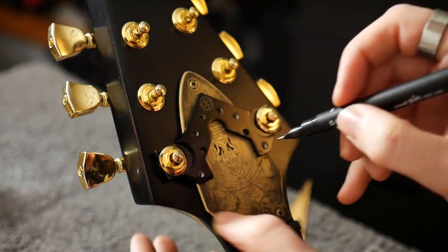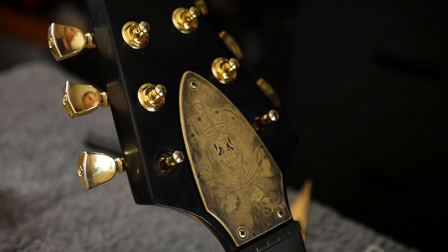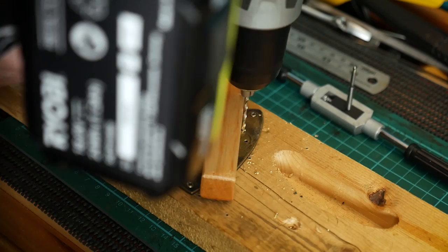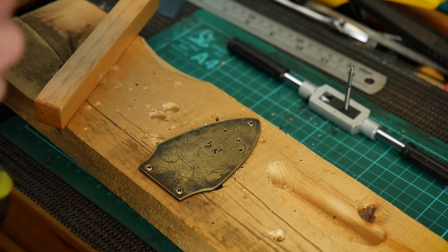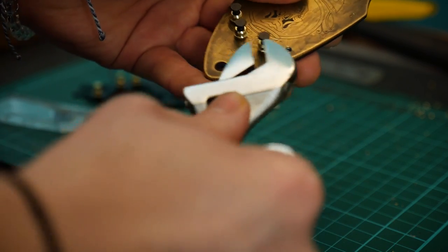By removing the posts from the string butler, I can place the plate into position on top of the truss cover, which is screwed to the guitar. This gives me the correct positions to drill the holes in the cover. The posts have an M3 thread, so by drilling the holes with a smaller 2.5mm drill bit, and then tapping them with an M3 tap, I can thread the holes to have the correct pitch to thread the posts into